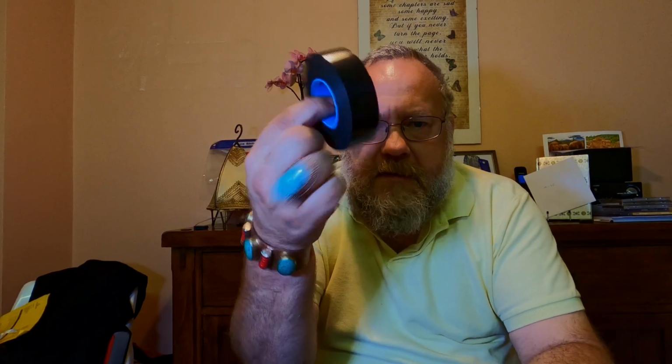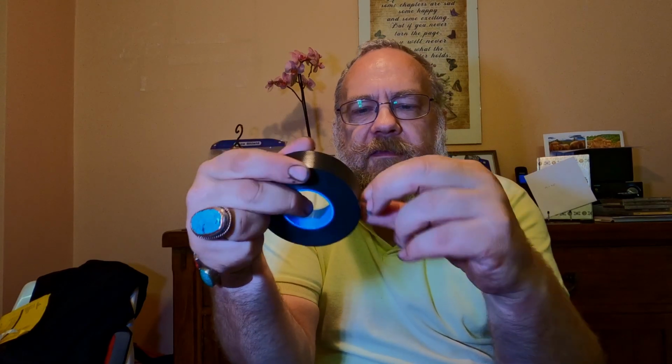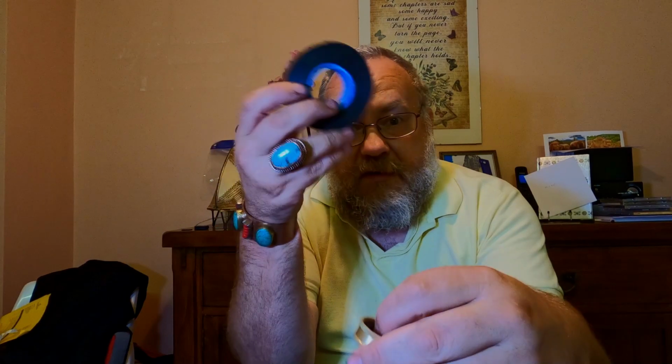A lot of them you need a washer and a half extra, which sounds strange. But the half extra I did by taking 4 or 5 layers of this. This is self-amalgamating SOS pipe repair tape. Basically it's a rubber tape that when you put it against itself, it sticks together and it eventually merges together to make one chunk of rubber. But it doesn't stick to anything else. It's used for when you've got a pipe leak, or I use it for virtually everything that involves joints, just to give a bit more sealant. Now I put 4 of them together and then I cut out a little washer shape. Not perfect, but it does the job.